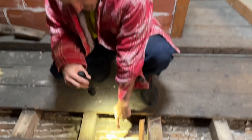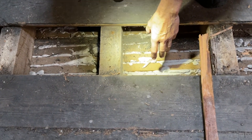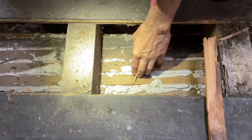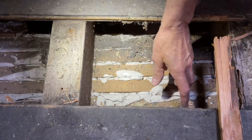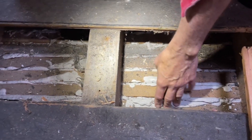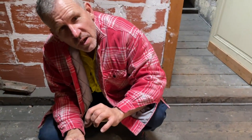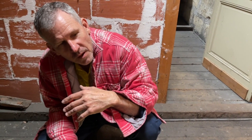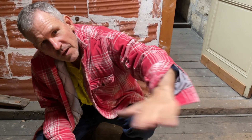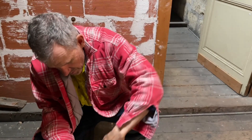Just have a look here — this is the old style plaster ceiling instead of plasterboard, or what they call drywall in America. The old style is timber slats with plaster in between, and it's very fragile. Because of this, most of these older buildings will never have a completely flush ceiling. But if you use plasterboard, you can get a nice smooth finish — whereas with these, you'll never ever get a smooth finish.